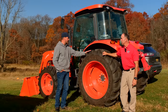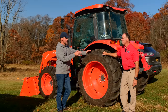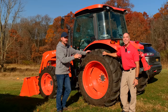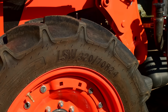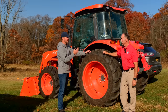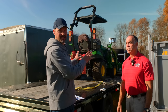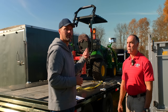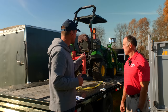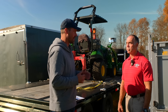Our Kubota M4 71-horsepower tractor needs about 6 gallons per tire of Hydro 1500 since it has Rim Guard inside, and then Pro HD 2500 on the fronts — 152 ounces per tire, 300 ounces total. It starts to add up with bigger machines. On the 1025 — this could be a Kubota BX or anything similar in the subcompact range — we have Rim Guard in the rears, needing 1 gallon of Hydro 1500 per tire, 2 gallons total. The fronts combined needed just a half gallon of the 2500 — and it has an indefinite shelf life, so it won't go bad.